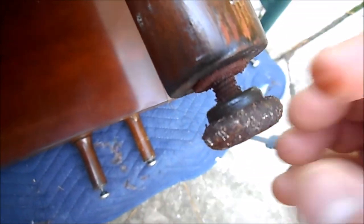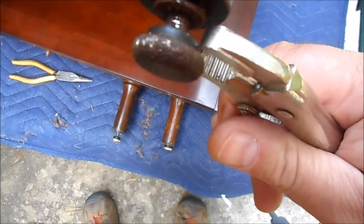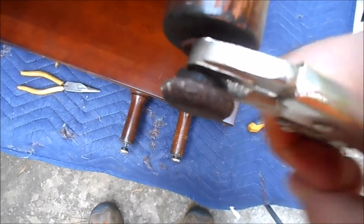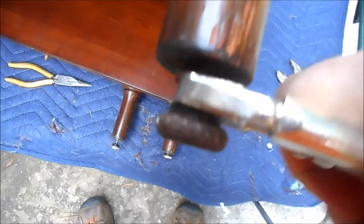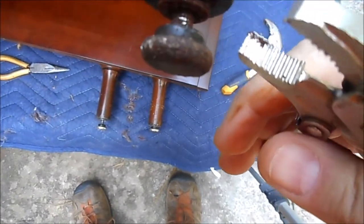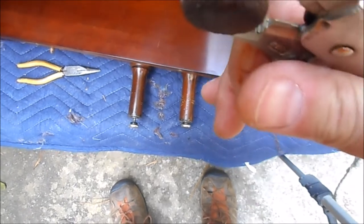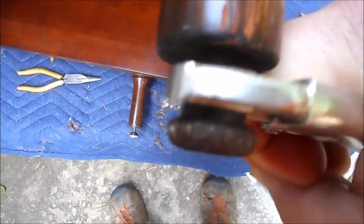This has been in here for some time. I've got a small pair of vice grips on here and as I started to wiggle that shaft loose, this entire assembly is going to come out - which actually is not a bad thing, because with it out I can work on it on the bench. You can see how that's starting to pull away, so I'm going to get a little pry bar in there.